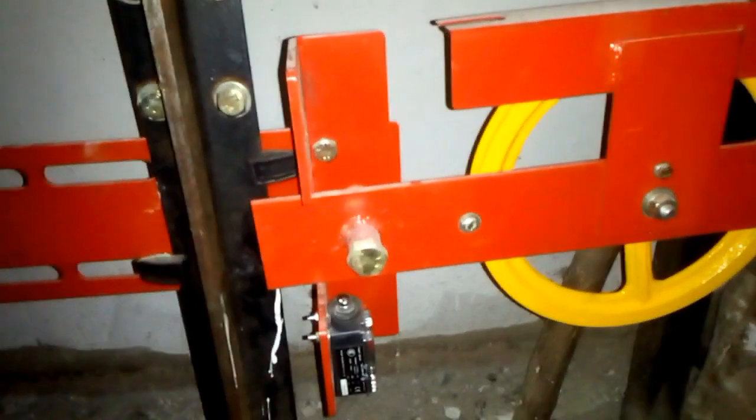You can see this is a limit switch — in case the lift increases speed, this supporting weight will come down and trigger this limit switch, and the governor will stop moving. These jaws inside — you can see them in there — they are toothed, one this way and another this way, and they will crunch into the guides and the lift will stop immediately.